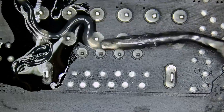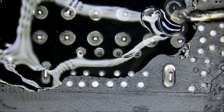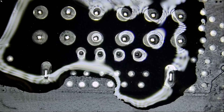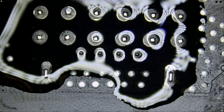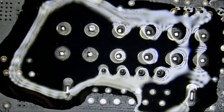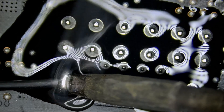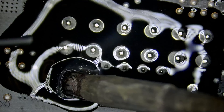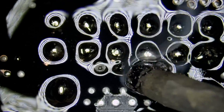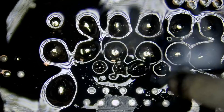Now we're going to apply flux, and the flux is going to liquefy quickly because the board is hot — just apply a river of flux. Now we're going to use low melt solder. The low melt solder that we carry and sell melts at 50 degrees Celsius, so when mixed with unleaded it's going to lower the melting temperature tremendously. I can already feel the pins move right under my soldering iron.